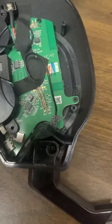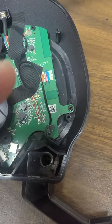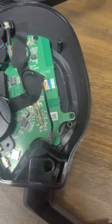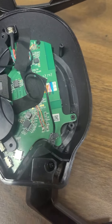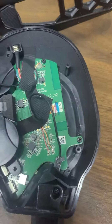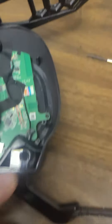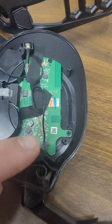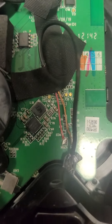So I took it apart here. That black wire right there — the way they have it in here is kind of a little wanky. Honestly, I just had to re-adjust it because the way it was, when you turned the mic, it would bend that cord. So I'm thinking it's disconnecting it from the solder right there.